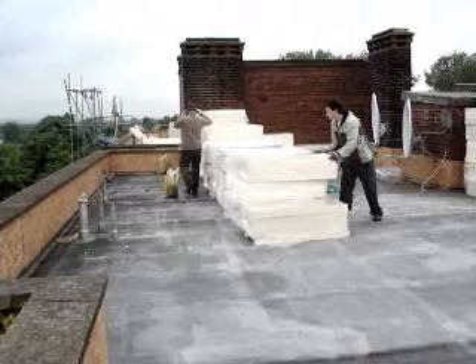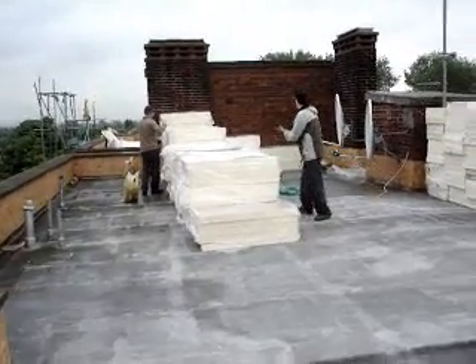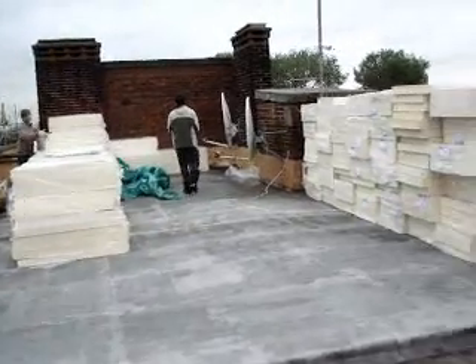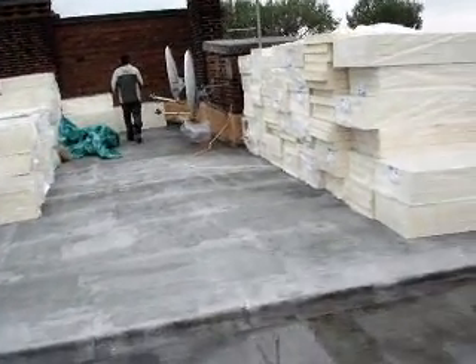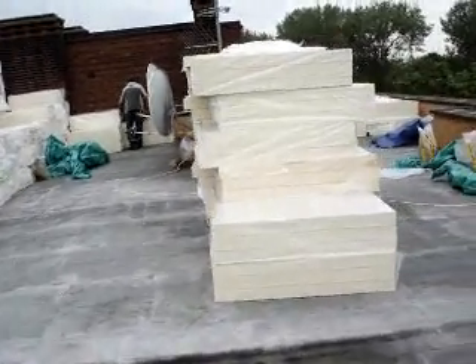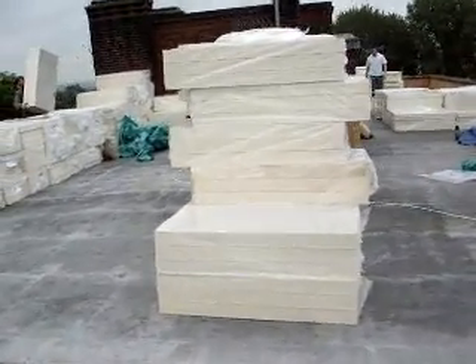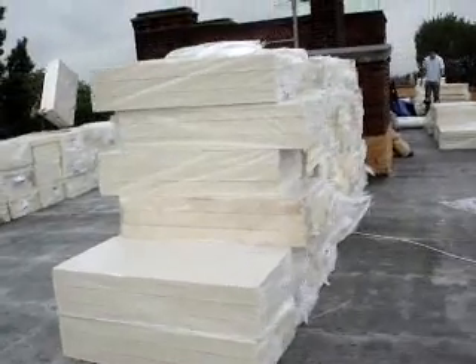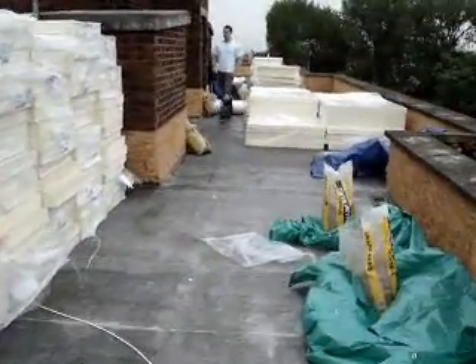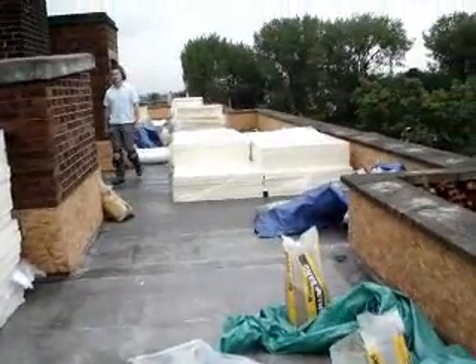Hello there, my name is Stephen Dickinson and I am the Main Surveyor for London Flat Roofing.co.uk. I am just about to show you a roof, about 350 square metres, and we are going to use a cut-to-falls insulation. That means the insulation is a wedge shape. By the time we are finished, we are going to make the water on this roof run from the front of the block to the back of the block.